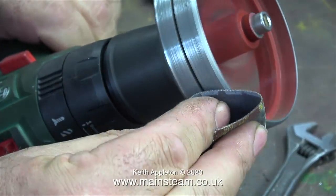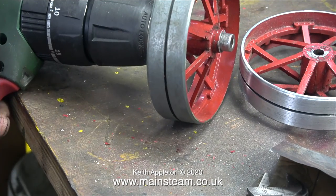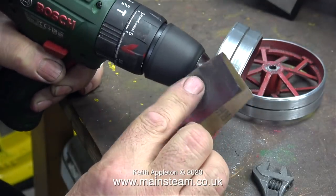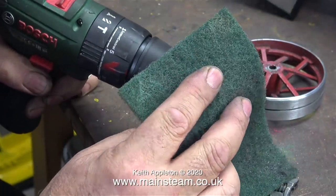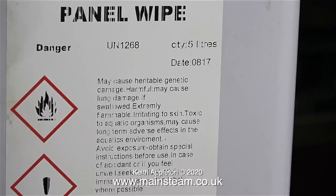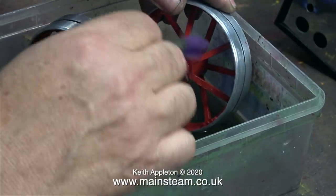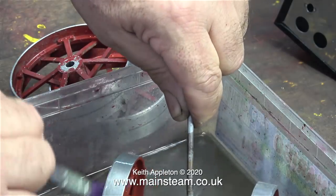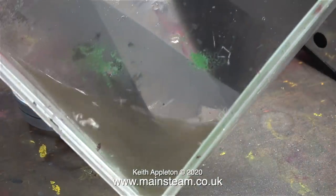It's possibly slightly more dangerous than doing it by hand but if you're careful you won't hurt yourself. First I used some medium emery cloth — this cleaned up the edge of the wheel very well and even got through some of the corrosion. I repeated the process for the second wheel, using emery cloth first, followed by wet-to-dry sandpaper, and then finished off with some Scotch-Brite. Scotch-Brite is like an industrial version of a scouring pad and it gets a great finish on the wheel treads. The wheels are very dirty and now have metal particles all over them, so I'm using some panel wipe — this is naphtha, a very good degreaser that evaporates very quickly. When working with panel wipe you need to be in a very well ventilated area.